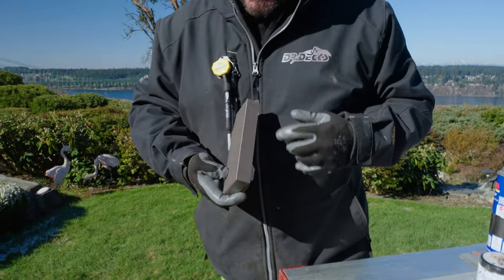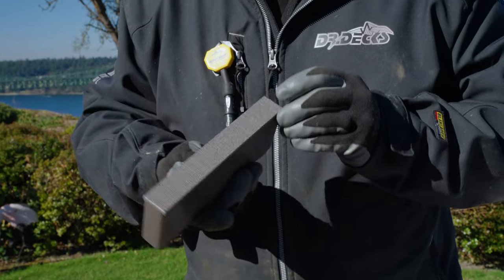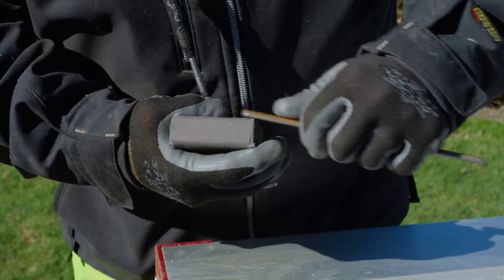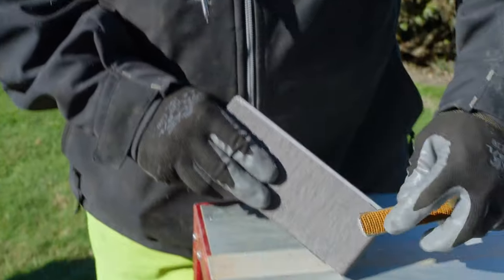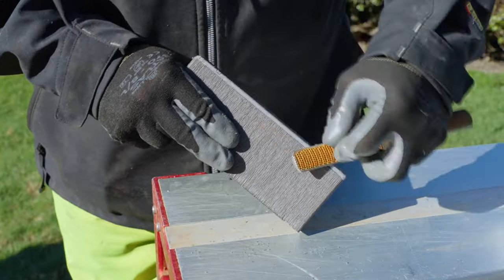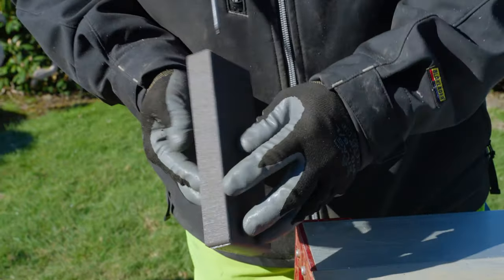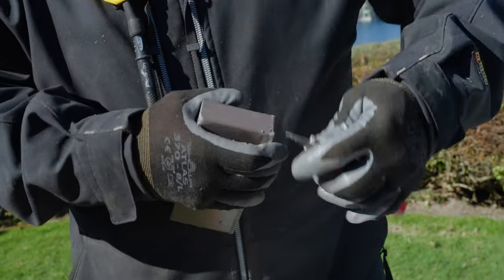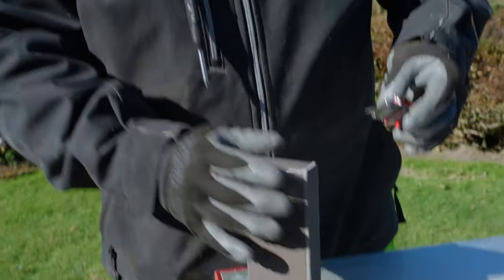It's stuck — it's on there. Here's the face of the board and here's the end grain of the board. We've got a little bit more work to do — you can see there are some sharp edges, so we still need to file this out. I'll take a rasp and run it around the curve of the board, because the board has a little bit of a curved edge. We did ours on a table saw. Then I'll rasp the face a little bit just to break the edge. If I'm a little high I might take my blade and just shave it, then file it again.